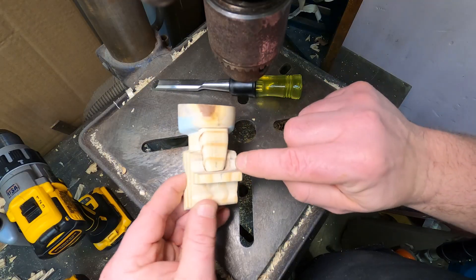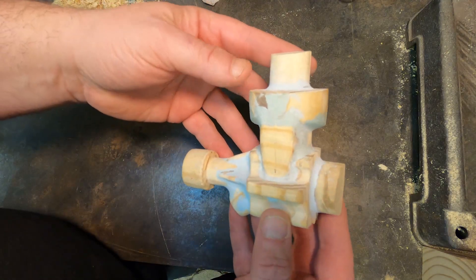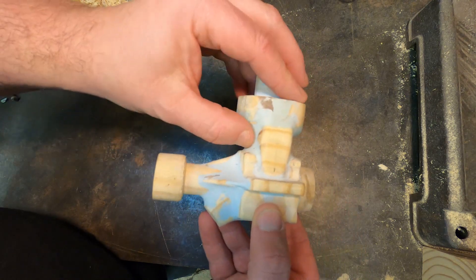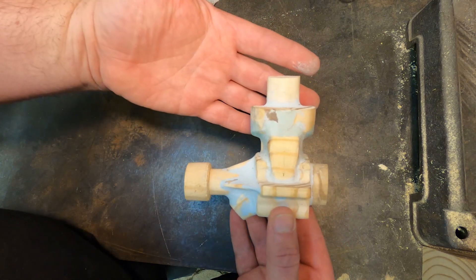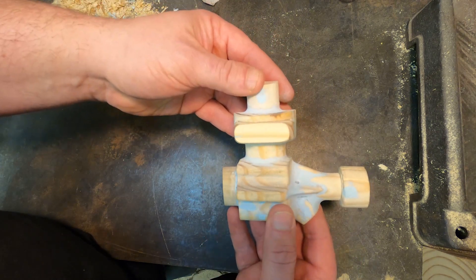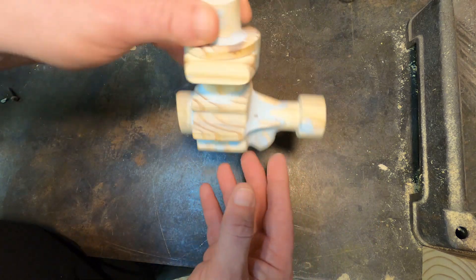I'll go along with filler in here and on both sides. Here it is pretty much complete — everything's filled and smoothed off, blended. All this blue stuff is body filler. This is the port side, here's the exhaust port side. These dowels here are for core prints. The carburetor is here — it's going to have the carburetor on the bottom.